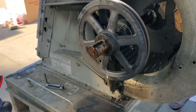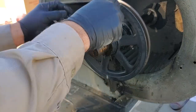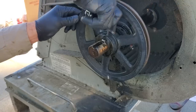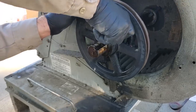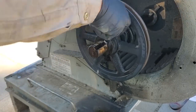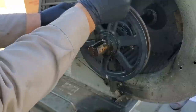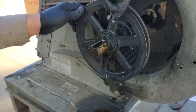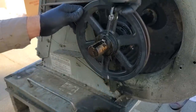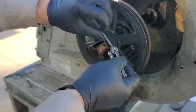What we're going to do is get the keyway out. Give it some WD-40 or penetrating oil to get this loose. You've got to watch out too, because as your Allen wrench starts to go bad, you'll think it's coming loose but really it's just stripping in there. I probably should get a better Allen — this is my tiny one that I keep in my bag. Don't lose any set screws. Save them all.